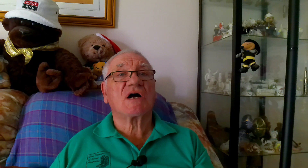What I'm going to show you is a simple fix — it'll cost you a little bit more money, but it is to fit an aluminium sacrificial plate so that you can drill and tap holes that suit your part. Also, it doesn't matter about the cutter — you cut your part and the cutter goes 10 or 20 thousandths into the aluminium plate. It's sacrificial. When the plate gets bad and you're running out of decent flat spots, you just re-skim the top and carry on. A picture tells a thousand words, so let's go to the workshop and I'll show you my rotary table with the sacrificial aluminium plate fitted.